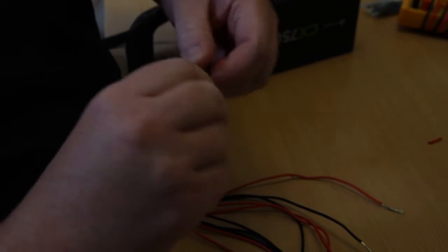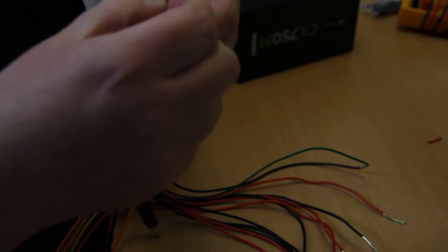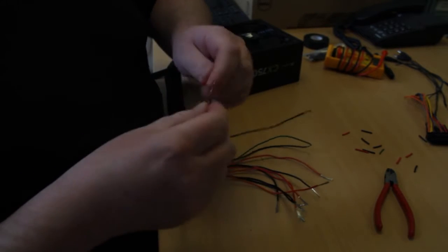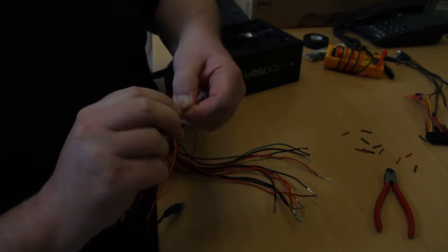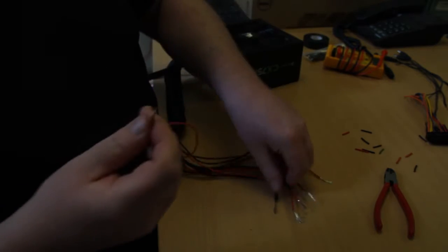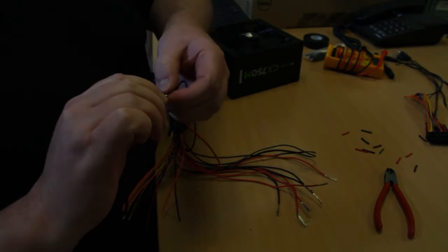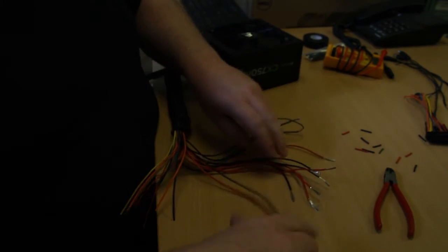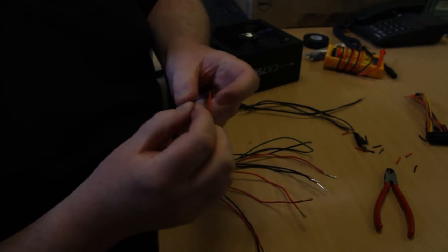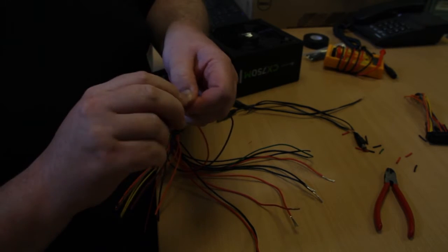And that means as soon as power is applied to the power supply, that power will go directly through the 5 volt cables. And we'll take one of the plugs. The stripe is the positive on these ones. Black to black. And just repeat up to 5 of them. So we're limiting to 5 because we think that the amperage required for 5 of these ODroids will be what the power supply can safely supply.